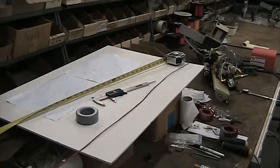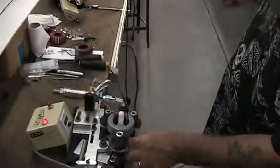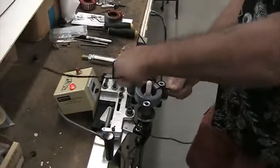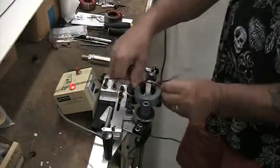We are now going to wind three windings of seven turns each of 10 gauge wire. The wires have to be pre-cut for the Gorman Machine Hustler pull winder. The core is 66 millimeters OD by 38 millimeters ID.